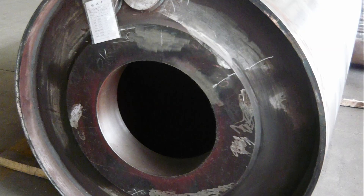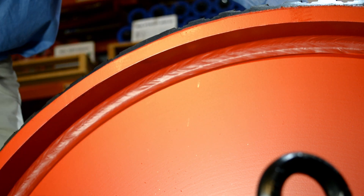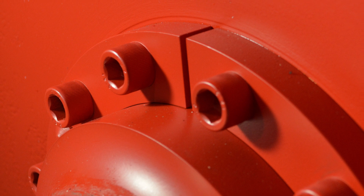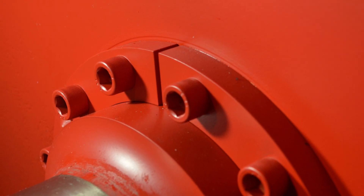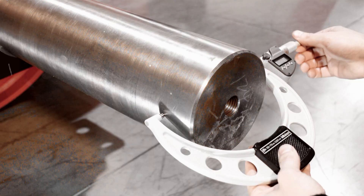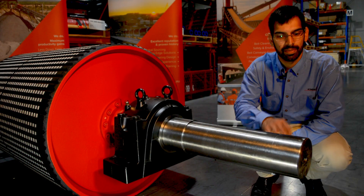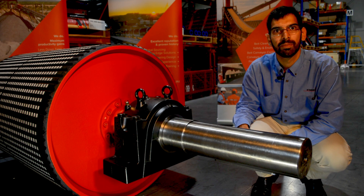The end discs can either be machined or cast, and both utilise a full penetration fillet weld. A weld-on shaft is possible; however, a far more superior form of shaft locking is the use of a locking element or taper lock. These can be supplied in quality brands such as TAS Schaefer or Ringfeder if required. All pulleys are statically balanced and tested for total indicated run out. Stress relief and ultrasonic weld testing can be provided on request.